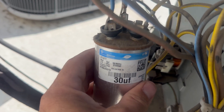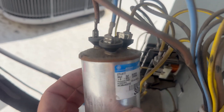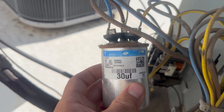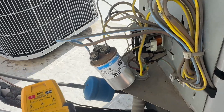...it's swollen up on the top. If it's rounded like a soda can that sat in the freezer too long, then the capacitor is bad. This is redneck capacitor testing — you can see that this is bad visually, you don't need a meter. I'm not even going to put test leads on this, there's no point.